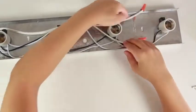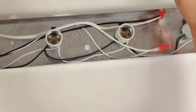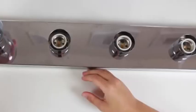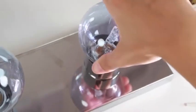Now that we have our wires connected with the orange cones on top, separate them when putting them back in so they're not touching each other. Then you're able to put the top back on and the caps back on. All you have to do now is twist in your light bulb and your vanity light is ready to work!